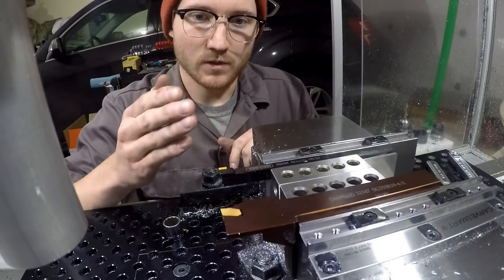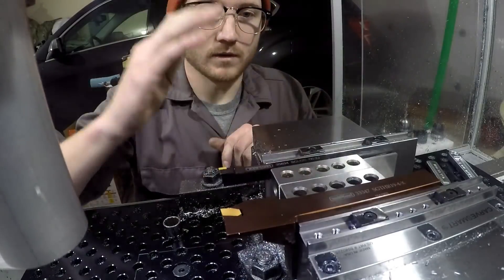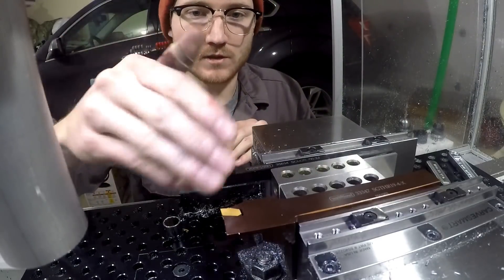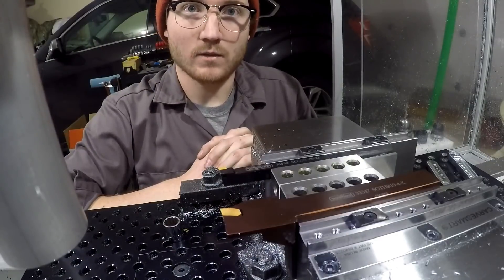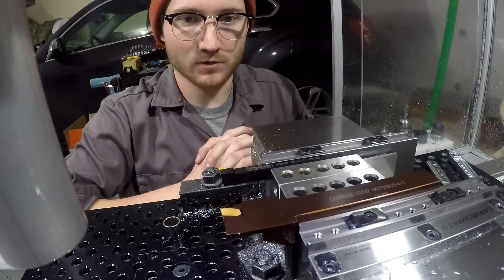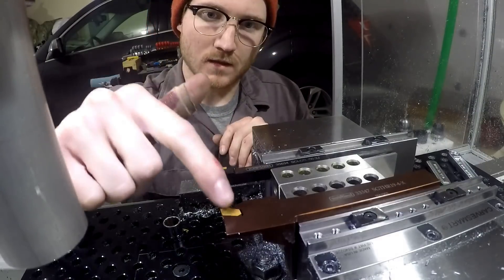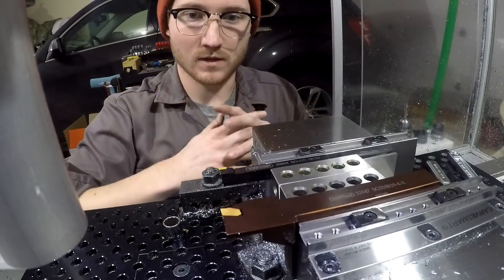And now that I'm actually doing it, I actually need to know it, which is a problem. I was looking up all the codes — CCMT, GT, whatever. It was just mind-blowing. It is literally a different language. It's a lot harder to know than end mills, because end mills use actual numbers, whereas these codes correspond to numbers — that's what determines what the insert is.